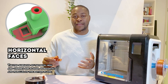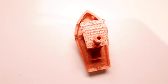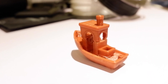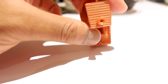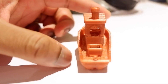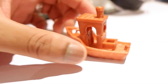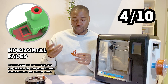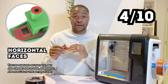The next item I'll be judging the printer against is flat horizontal surfaces. When you look at the flat surfaces — the bucket on the back, the actual deck itself — you can see that even printing at standard mode, there are a lot of bumps and warping. It's tried its best to print these areas smooth, but it didn't really do a good job. I'll give it a 4 out of 10 for flat surfaces. If it was printed at a higher quality level, it would probably be smoother, but at standard mode it doesn't bode well for flat surfaces.